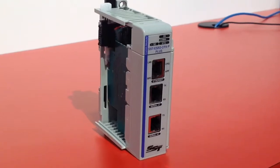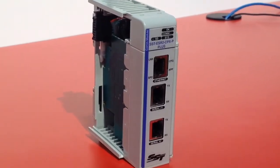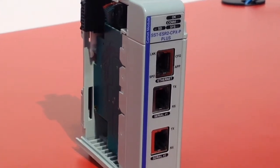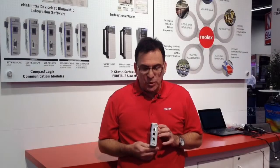The Universal Modbus cards have two serial ports on the front. They can be configured as a Modbus Master or Slave, in ASCII or RTU formats. And with that Ethernet port, we can also set that up to be a Modbus TCP client or server device as well.